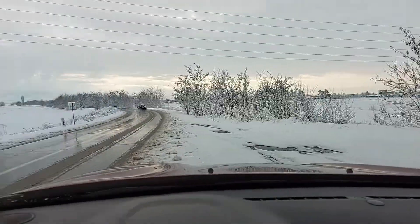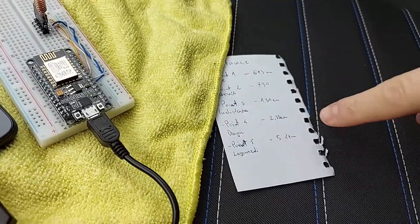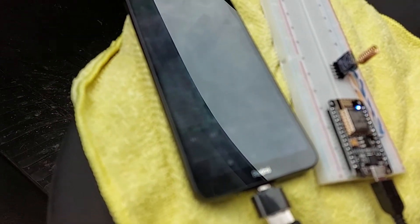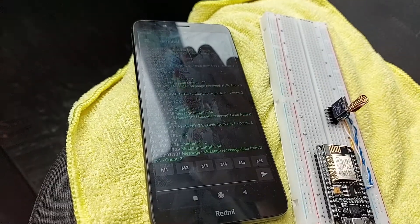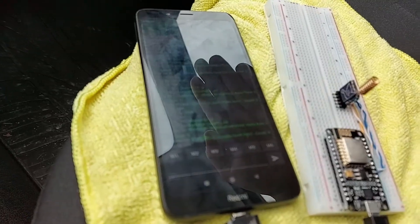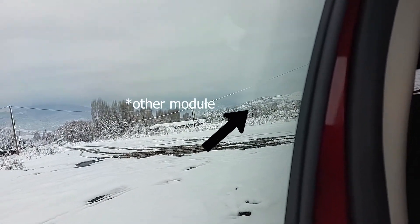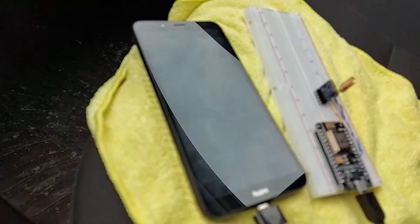Checkpoint number three — we're currently outside of the city and this is about 2.3 kilometers. I've measured all the distances before I went out. I'm going to try it first with me being in the car. And we actually get a response! You can see we got a response for count three. Let's do that again — we sent count four and we got a received message for count four. The other point is way, way back there at 2.3 kilometers — that's line-of-sight distance.